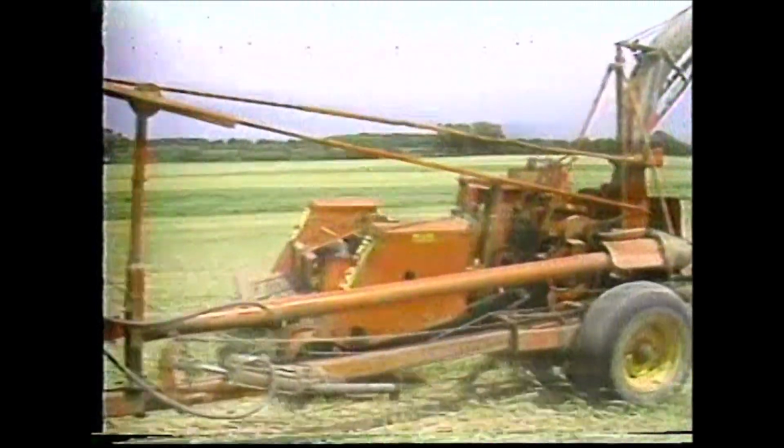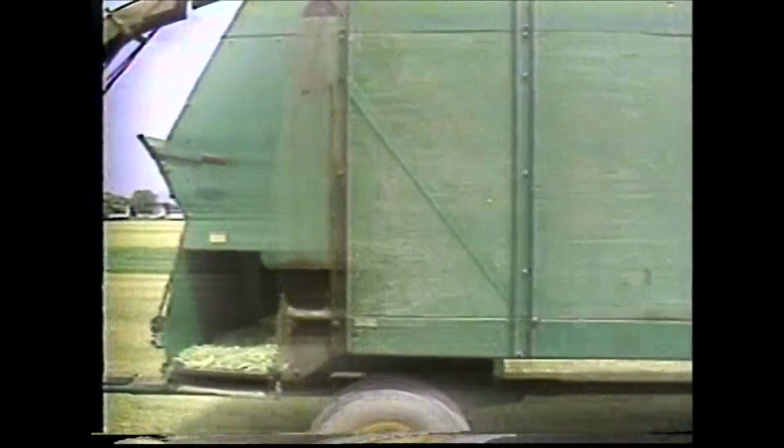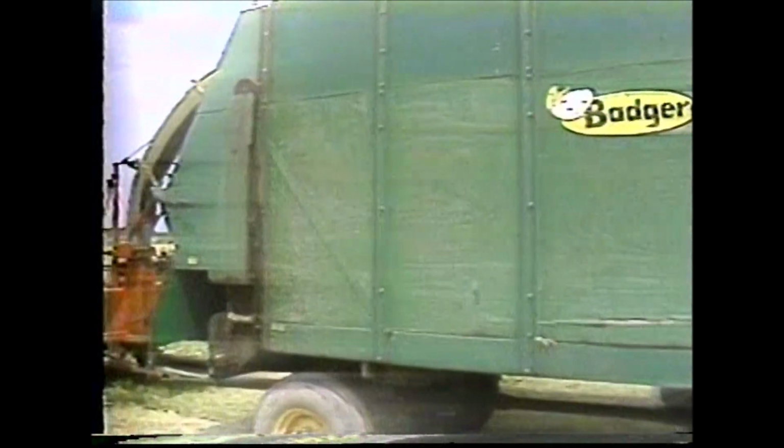There is never a compromise on travel speeds because the R.P.S. lets you match engine loads with drawbar loads. It lets you increase your working speed, farm at 5 miles per hour. Lets you control the throughput on PTO machines by controlling the ground speed to the crop input.